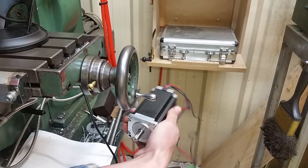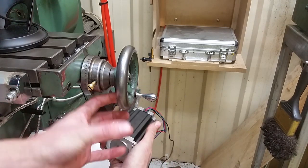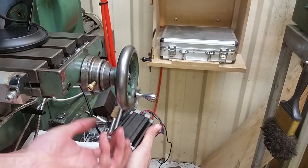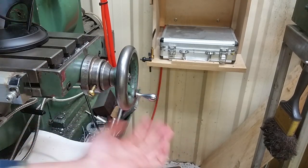So what I'm going to do is turn this motor 90 degrees and have a gearing arrangement to drive it from the side. I'm going to have my motor, a gearbox arrangement, a clutch — and all this is going to hang down from the table so it's clear of the hand wheel. And that's what we're going to make today.